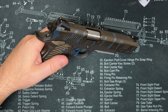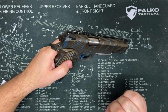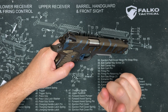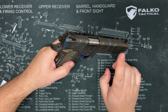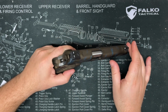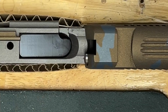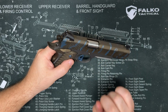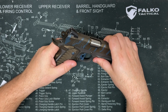It is what it is. The other reason why I say I probably wouldn't do it on my first 1911 build if I was doing this in hindsight is because, as you remember, I had my slide perfectly fitting my frame, and then obviously I added those thicknesses. I didn't have that perfect fit anymore. I had to put in a lot more effort to refit this slide to this frame than was probably normal for a build. You saw me really struggle with that.